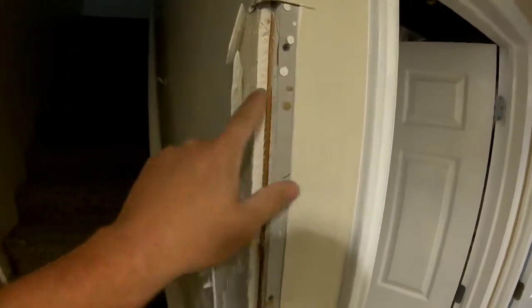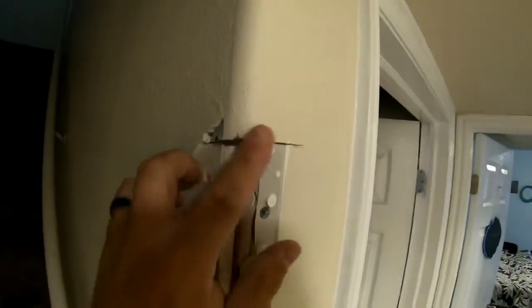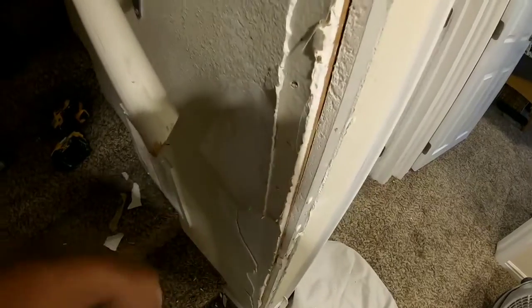On new drywall, when you anticipate using bullnose bead, you hang the drywall like this. See how it's not met up? So you want to leave that small gap in there to accept the bullnose. If you were doing square bead, you would hang that drywall just a little different.